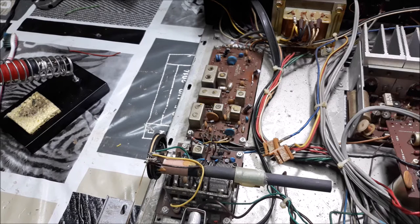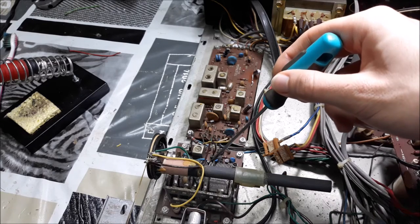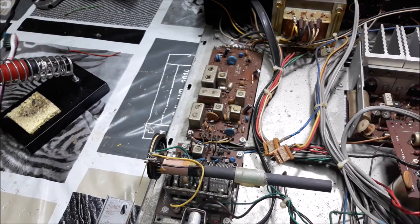I could fix it, but this is going to a home with a tube radio so I'm never going to use the tuner anyway, though I would like to see it working. I found a bad transistor on the FM front end, but changing it did nothing. FM oscillator is working but it's just barely distorted and with poor selectivity.